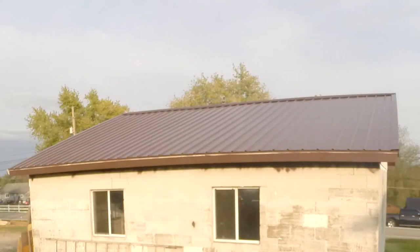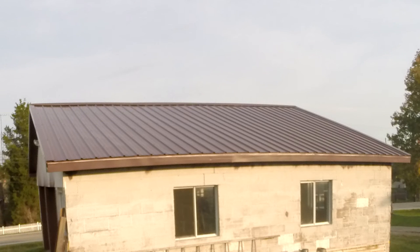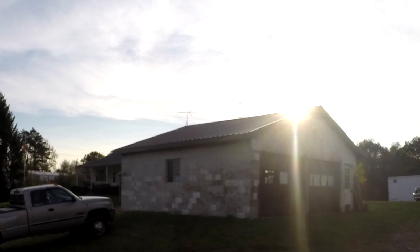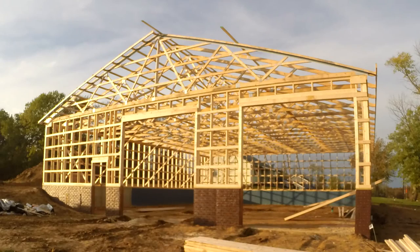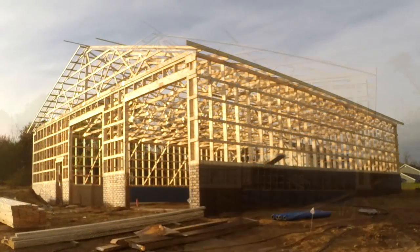The contractor showed up yesterday between 10 and noon. Part of their scope of work is to do a metal roof on this building — I looked into re-shingling it myself and would have had $700 in shingles, but for $1,480 they put a metal roof on and I never had to touch a thing. By two o'clock the roof was complete. It amazed me — they couldn't have had three hours in it. An extra $250 covers new gutters and downspouts, which aren't done yet. Then they moved over to the new building and got the sill plates on — drilled them, put sill seal down, and put treated 2x8s over the whole perimeter.